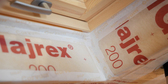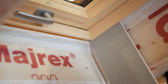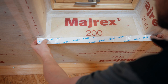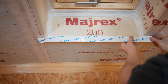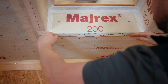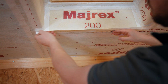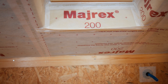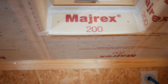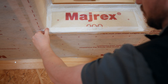Now the corner is perfectly airtight and there is still enough space to install the corresponding covering. Extend the lower membrane with a strip of Corvum 3030 and seal it. Now remove the backing liner and cut Corvum from the corner in half. Press Corvum down from the center in all directions outwards.